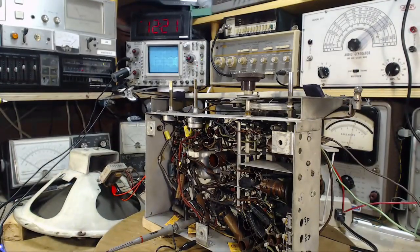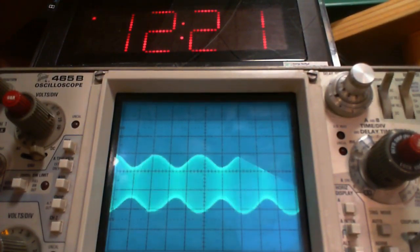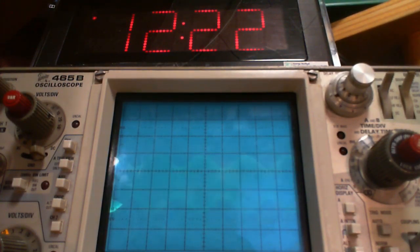But here's what doesn't make sense about that. In fact, I think that shouldn't be there. I think that signal you're looking at, right there, I think that should be flat. I think this big capacitor should be knocking all that AC out. That's what's across the cathode resistor. I don't think you want any of that across it. So this is suggesting that capacitor is not doing its job, or maybe it's undersized, because remember the schematic says it should be a 0.1 when in fact it's a 0.05.